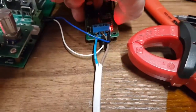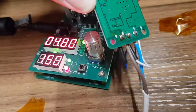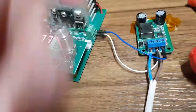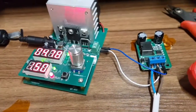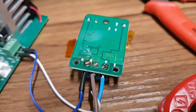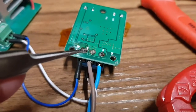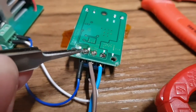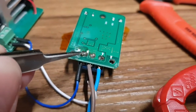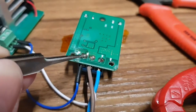Because remember when we saw that, one of them joints looked a bit crusty. So I reckon if we reflow that, that'll be back working again. Right, I'm going to try that now. Right, joint's resoldered, although I'm not happy with it because this pin here is very tarnished and it didn't take solder very well. It needed a lot of heat. It still hasn't made a fantastic joint. I think ideally you need to change the connector because that joint's just rubbish.